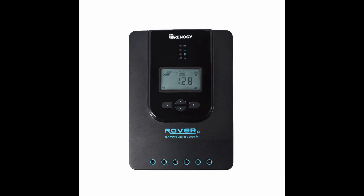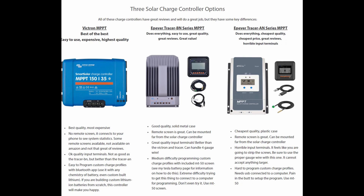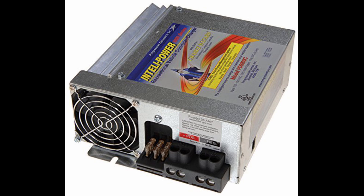This is totally fine if you have healthy cells, but if one is mismatched you're going to have to change the upper limit voltage. But let's say you can't change the upper limit voltage because you're using a cheap solar charge controller that's very difficult to program — like some of the Chinese ones where if you don't have the MT50 screen it's very difficult. If you're using a Victron or one of the ones I recommend on my website, you can change it in seconds. But if you're using an old RV charger that charges up to 14.4 volts and you can't change it, that's a problem.